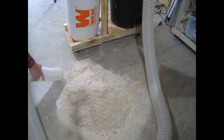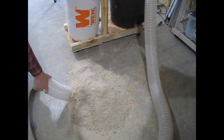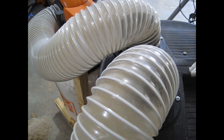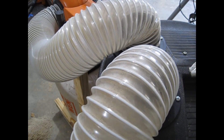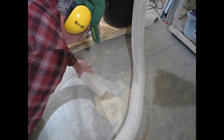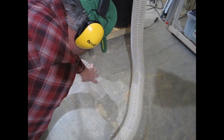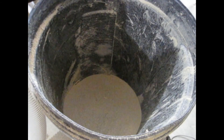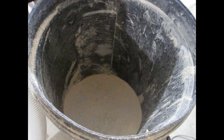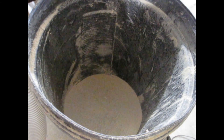This is way more dust than you would get from tools, so it's a harsh test of the separator. You can see how the dust is on the outside of the hose bend going in, and a small amount is in the hose coming out. Looking at the trash bin and the bag, I think at least 95% of that dust was separated into the bin. Dust in the bag was very fine particles.